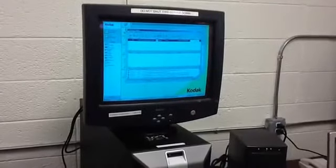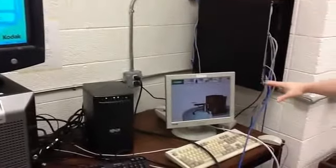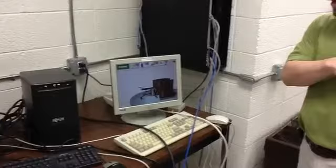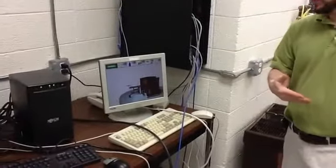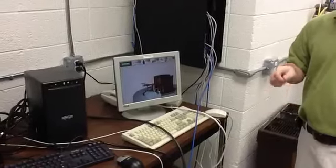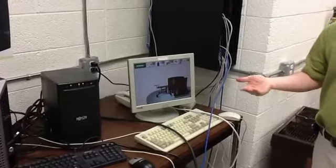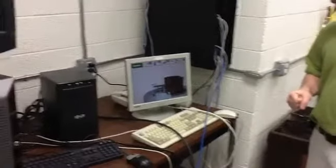a plate. So the Lotem, this is the Lotem controller. It represents the computer inside. It's showing you the progress. It just removed the slip sheet, and now it's going to pick up the plate. It's set up for our presses. It's punch registered. I think there are 3 punches on it.